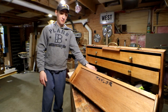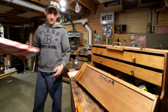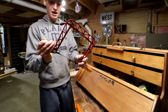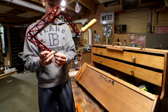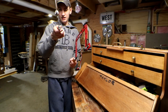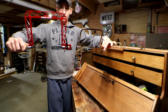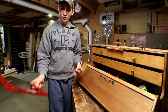The gift that my brother got me for Christmas was a New Concepts coping saw, and I want to use it at work. This New Concepts coping saw is really awesome. It's amazing. It's got a cam lever tension. You can set it to whatever you'd like. It's got detents at every 45 degrees so that the blade is always straight. It's not twisted like this one when you tighten the handle. And the blade's just much, much tighter. It's actually, believe it or not, even though it's way larger, this is much lighter than this. This is aluminum. They also make a titanium one.